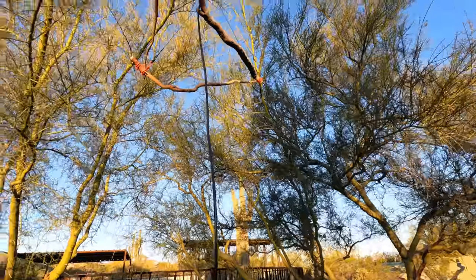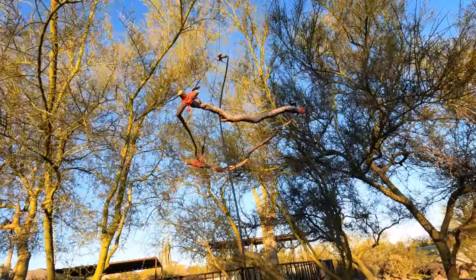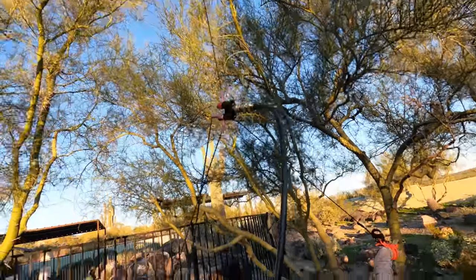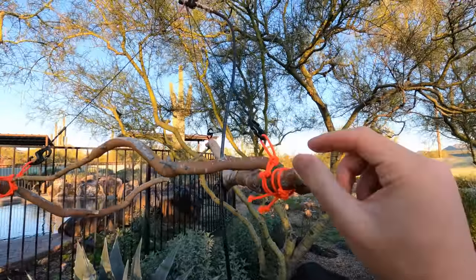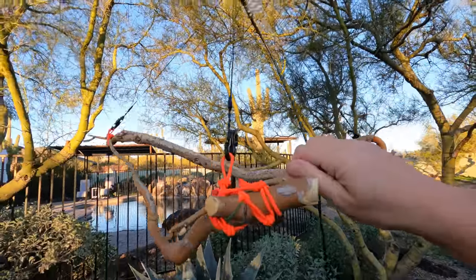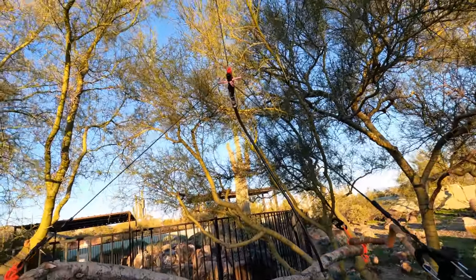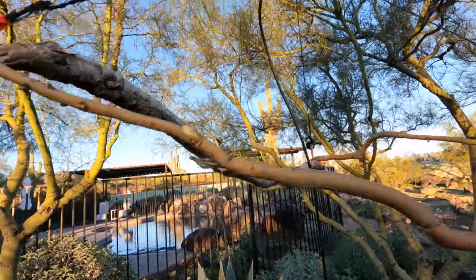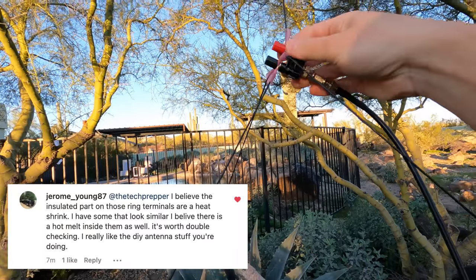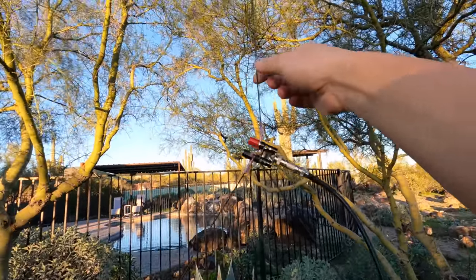A little bit better, not by much compared to the tuning I did. Give me a second, I'll break it down and we can take a look at the actual MacGyver setup. Let's bring her down. We're up about 12 feet. Everything out here wants to snag, pinch and bite you. I'll talk about how I improvised some bungee cord here — I actually like the technique I used for the lashing. I have two or three two-and-a-half foot stakes, and I'll talk about these little overhand knots I put to make the guy line easier. There's a little bit more weight than I would like but it is keeping this at pretty decent angles.